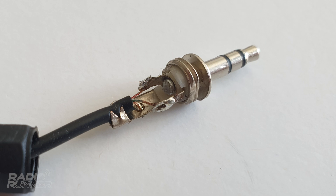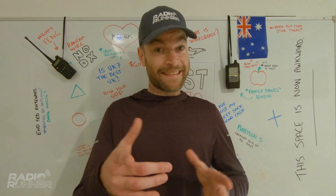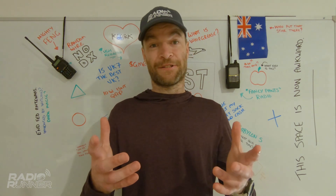This thing has bounced around in my pack for hundreds of kilometers, and it's been fantastic. And this is the end result. Remember to put that sleeve for your 3.5mm plug onto the wire before you solder it together. If your radio uses a different plug, just grab a pinout for that plug, get yourself a plug, and put it together. That's it — I hope you enjoyed it, and I'll see you next time.